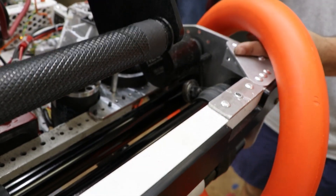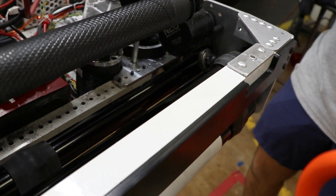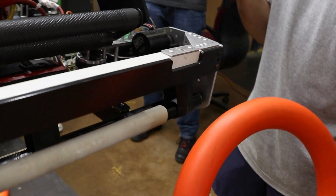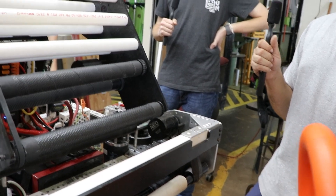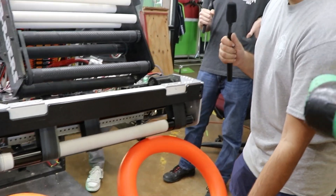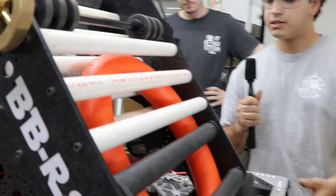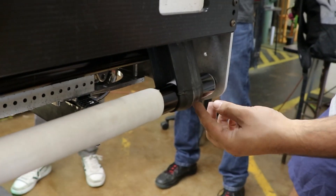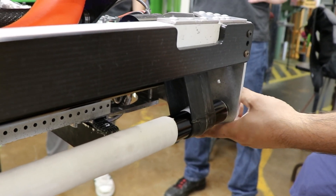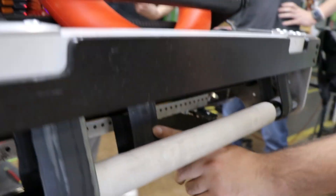This is the second iteration of that bearing centering piece. It used to extend further into the intake, but we shortened it because once a note comes in, it gets hit by the NEO on the side, which pushes it more toward the center of the robot. So if we intake on the right side, the bearings push it into place, compared to when it's centered and goes in on its own. We also switched to poly belt instead of actual belts so we can get lower to the ground, since standard pulleys can crack when super low. We have two poly belts on the front roller and one on the back, which actually helps with grip on the note.